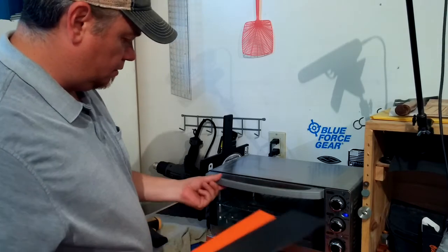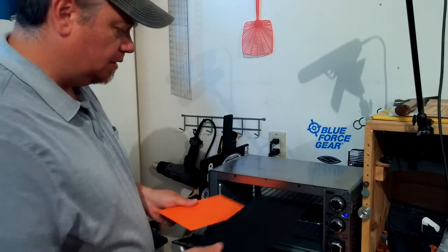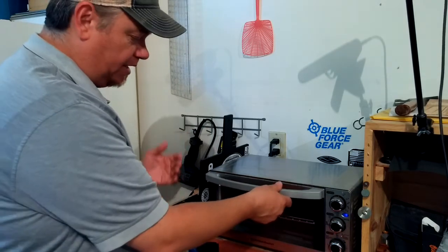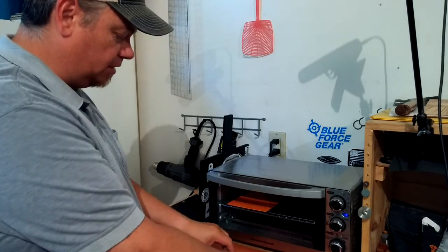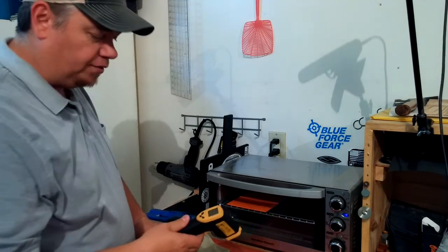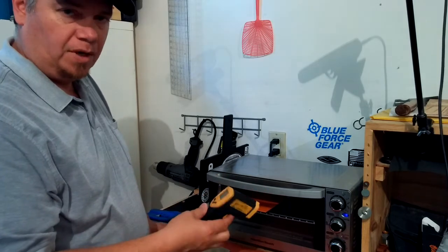And I've noticed, it seems to me, that it heats fairly decently. The colors don't really matter so much. They heat pretty evenly. It's the thickness. So if you're using one size that's a little bit thicker than the other, it may heat a little bit unusual. If you're going to do this process, invest in a digital laser thermometer.